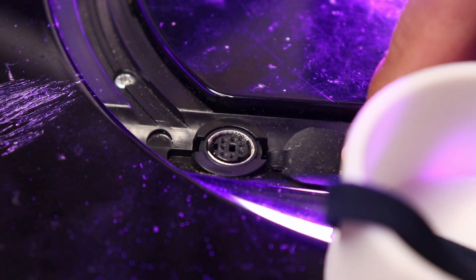As it turns out, the Roomba has a serial port — I had no idea. I've owned this thing for two or three years and never seen the serial port. So after seeing that, I thought I could just connect something like a Raspberry Pi to it and control the Roomba using the serial interface without having to take the whole thing apart and figure out all the leads. That was super helpful.